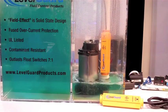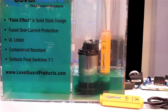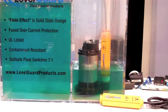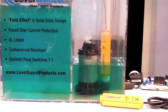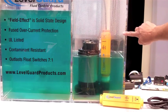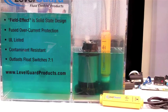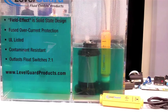Shown in application here is the Level Guard residential sump pump control. As you can see, it easily mounts with two tie strap attachment straps onto the discharge pipe of the sump pump. As the water level increases, you can note the two switch points — there's an upper and lower limit. You can see the upper limit here and the lower limit here. As that water level rises to that switch point, field effect sensing technology is going to detect the presence of that water, and at that point it will make a logical decision to turn the pump on.